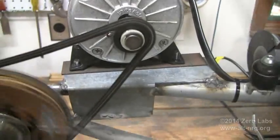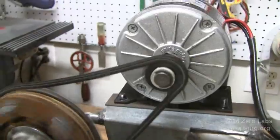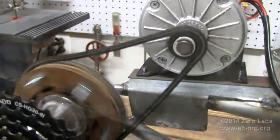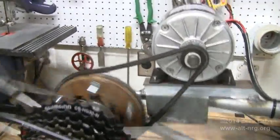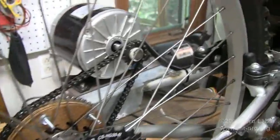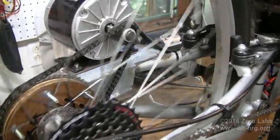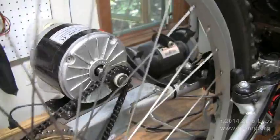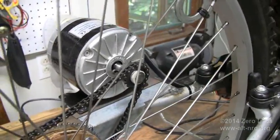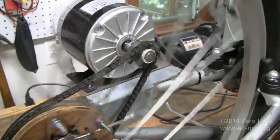On the opposite side of the wheel hub you can see the electric motor. The motor itself is not spinning because that sprocket on the shaft is a one-way bearing, so it's freewheeling in one direction and drives the tire in the other direction. The only downside to this setup is that there will be no regenerative braking. But this is a speed test, a competition, a one-shot deal. Going in this direction you can see the motor shaft does spin — you can see the shear pin on the shaft moving — but in the other direction, it doesn't.